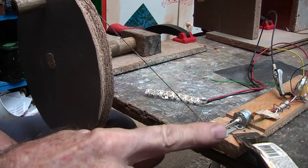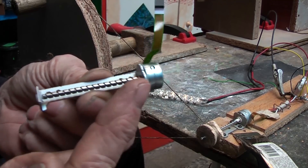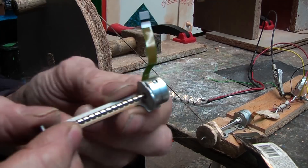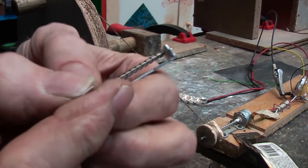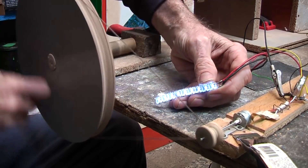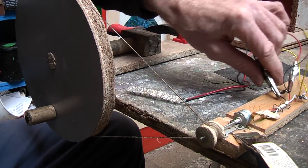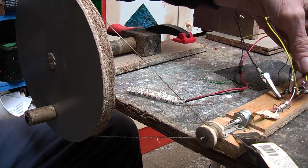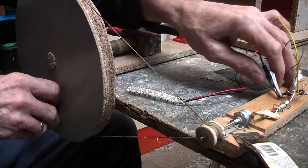Here I have my testing wheel with a little motor from a floppy drive. It has a spiral on it. The difficulty with this though is even though it is so small, it only has one bearing here and one at this end, so I had to cut that and slide it back to be able to get enough to put my pulley on. The motor has a ribbon with four wires; I split it carefully and connected it over here to 9 or 10 LEDs, and one circuit is quite capable of running those 10 lights. But if I want to combine the two circuits, I have to connect a bridge rectifier to be able to combine the two, or one of the circuits sucks the electricity from the other. But it works quite well.